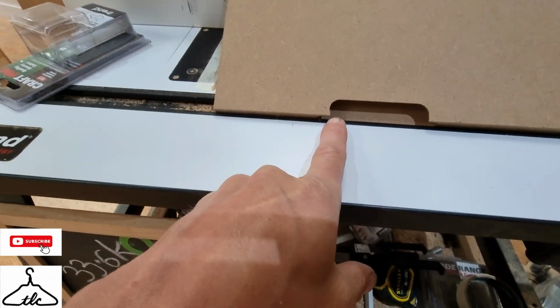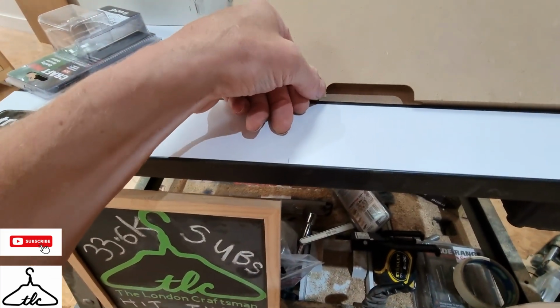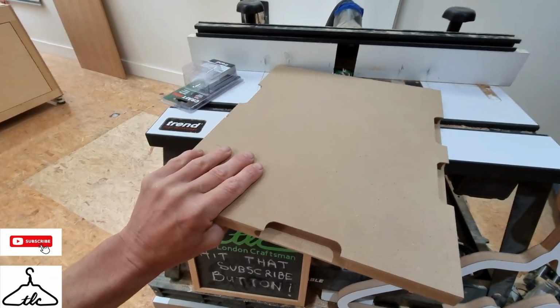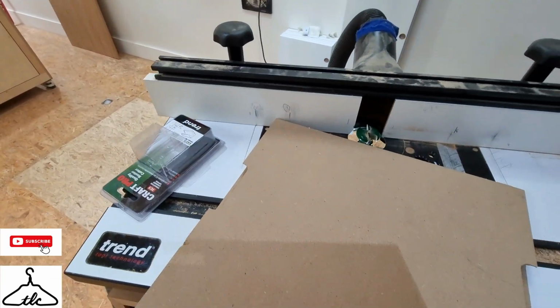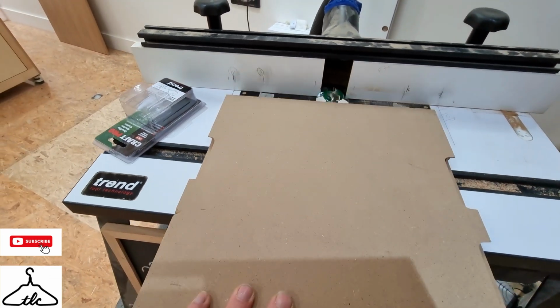it will give you a slightly out of line or out of square plunge on the edges, okay? That's because as you're plunging in initially, you've got to start it with the tip up against the fence and then slowly push it in. Maybe not so much when you're finished because you can pull that out square.